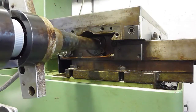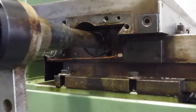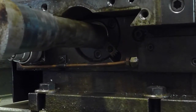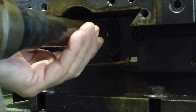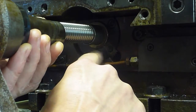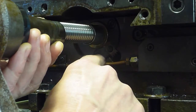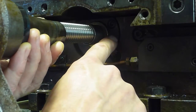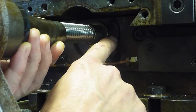What we're looking at here is the lower angle on the table, zoomed in slightly. We can see the adjustment block - what actually holds the ball nuts. I say nuts because there are two of them. You can see there's an elastic cone cover right over the top of the ball screw, and then we've got this pillow block arrangement - it's not really a pillow block because it hasn't got a bearing in it. It's the retaining flange that holds the two ball nuts in place.